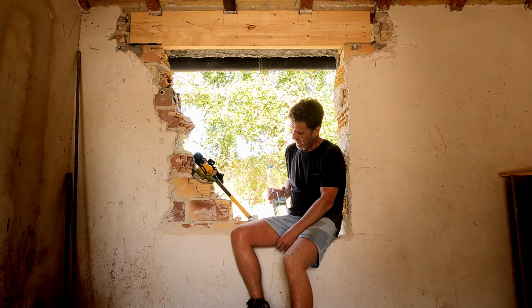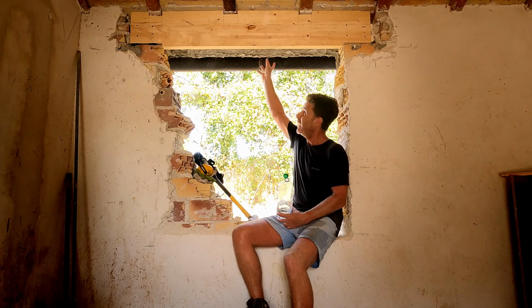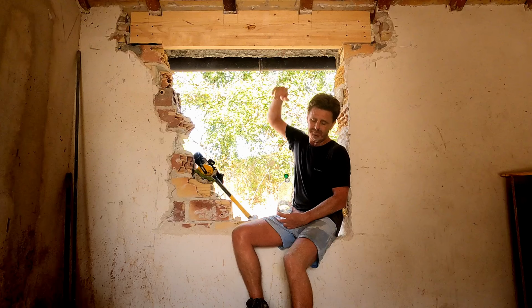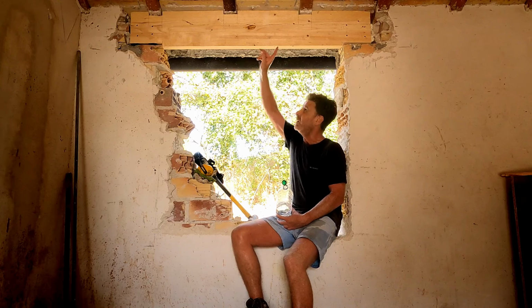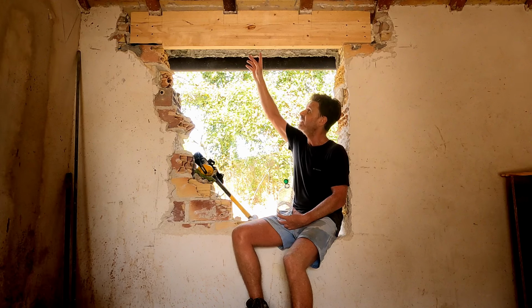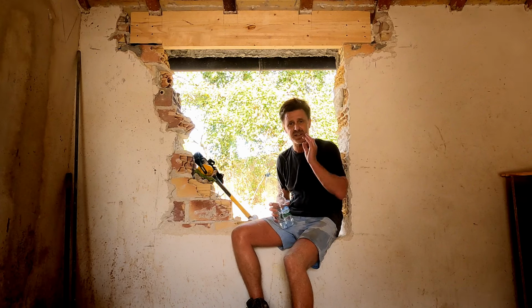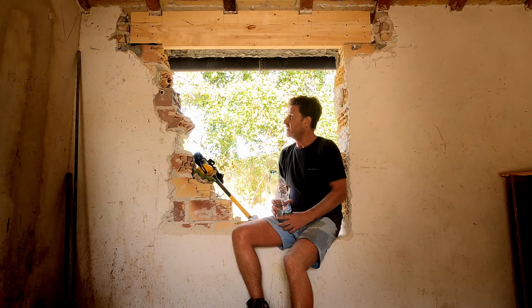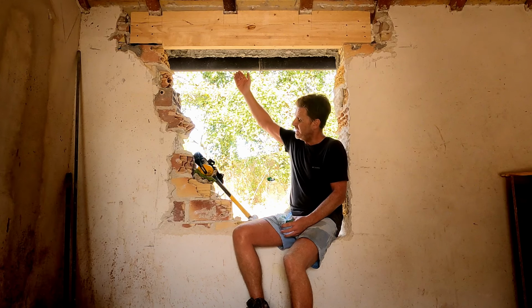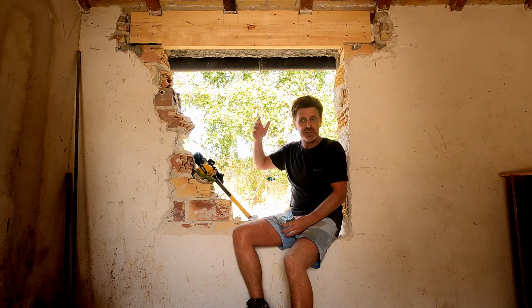Anyway, it's going really well. I don't know what it looks like your end, but I'm really pleased that this structure, the main lintel is really solid. This is just, I'm gonna attach something this side and attach something this side. So it's more aesthetics, it's not that supporting, should we say? Although it's got an element of support to it. But the main beam now, I'm really pleased that it's solid, it's good. So my plan is to shape the window that today and render it all nice. So it's a nice level top, two sides and base to work from.